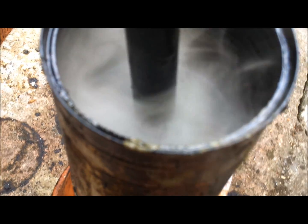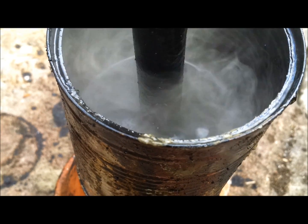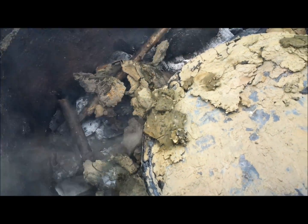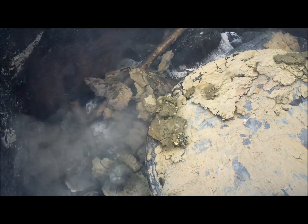After a while you start to get that gentle bubbling and inevitable smoke coming out the top, but hopefully we're now going to start condensing the light oils and then eventually the heavier oils and then the tar. Occasionally you'll see a bit of leakage out of the top of the tin, especially if you've used it two or three times — just use a blob of clay to stop that from coming out.